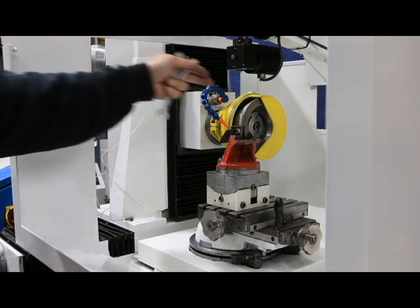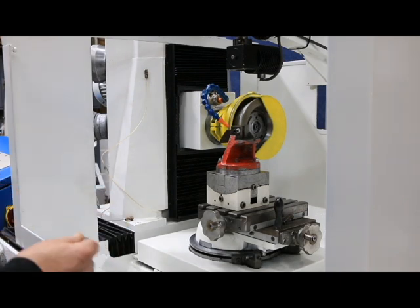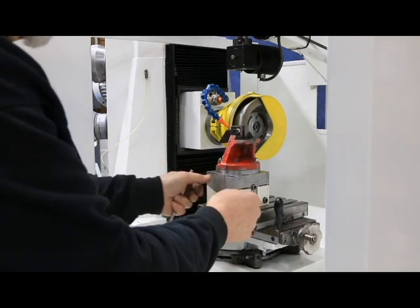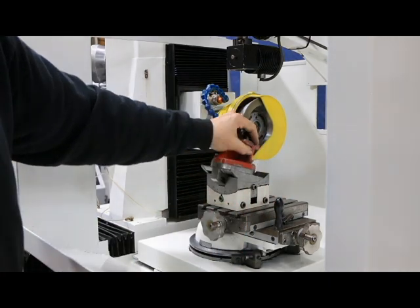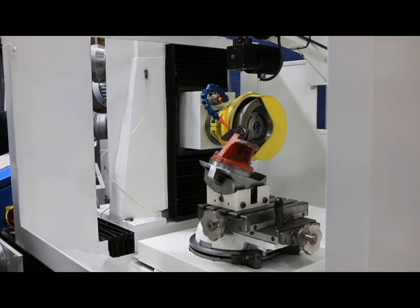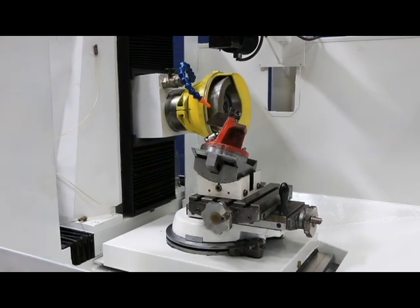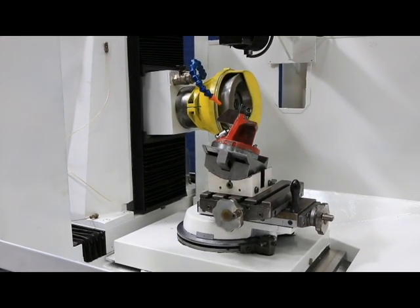The machine also comes with the one grinding diamond wheel that's on it, plus there are two additional diamond wheels that also used to come with it. This fixture has little eccentric cams, so you don't want to tighten any one of these things too much — that's not how they're made to be. They're made just to be loosened, and then you have movement this way as well as movement this way. So with all these different movements, plus being able to turn this, plus this can be pitched — it can go to different angles as you crank this — and you can set that back to zero. You have the line right here and you can come up with any possible configuration or angle you need.